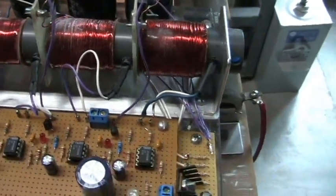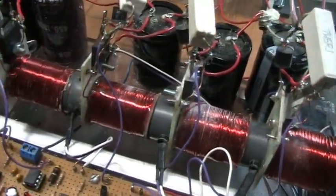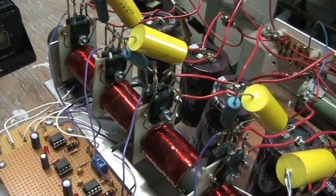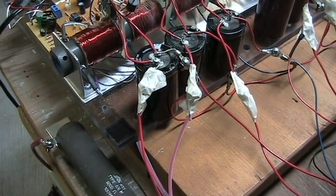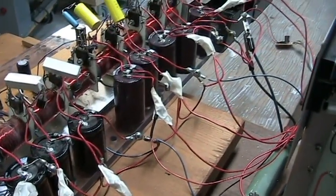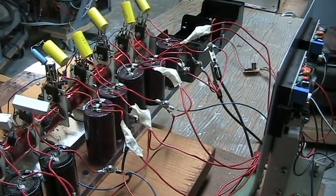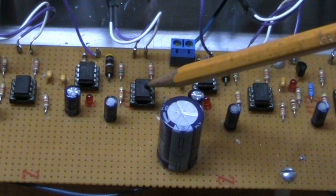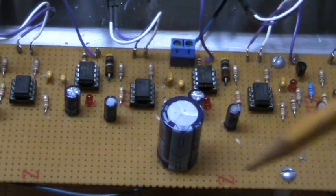I have an overall efficiency on the first three stages of about 6.5%. The following five stages use IGBTs. The first stage SCR uses an 820 microfarad capacitor; the next two stages are 330 microfarad. The IGBTs use a 1000 microfarad capacitor. I'm using an LM311 comparator for the phototransistor trigger and TC4422s as the driver for the IGBT transistors.